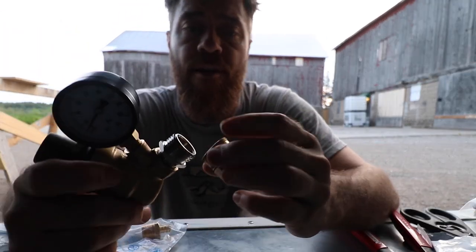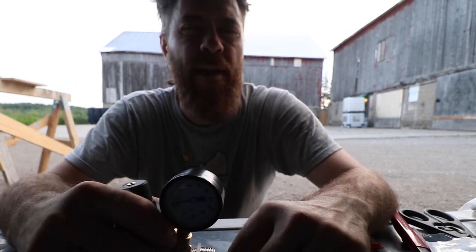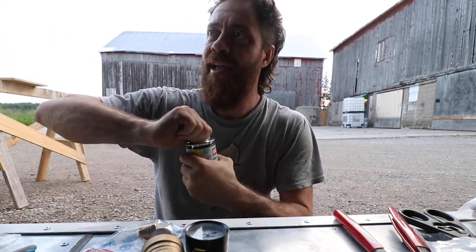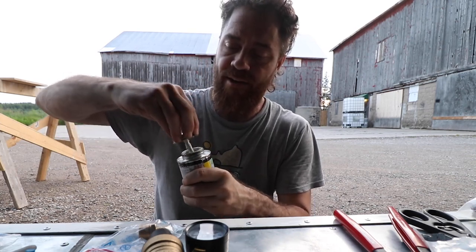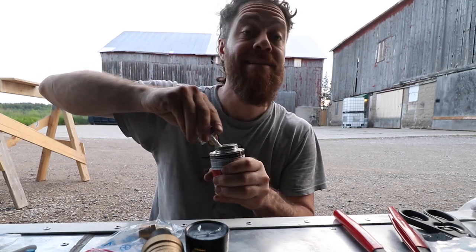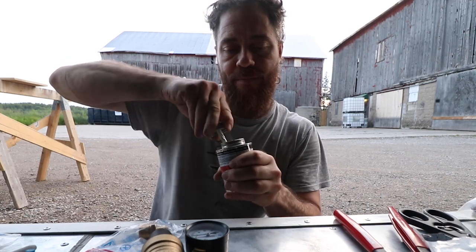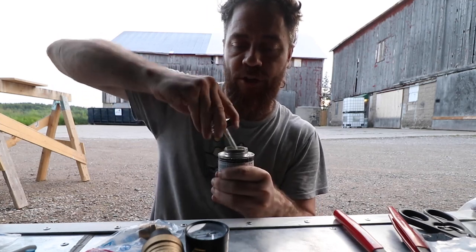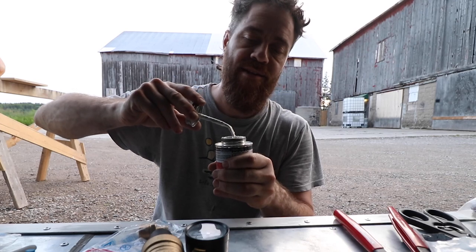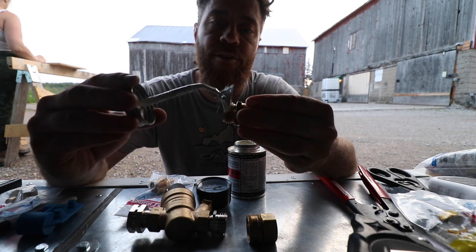What I'm going to do is because garden hoses notoriously leak, I'm going to put a little bit of pipe dope on the threads instead of Teflon tape, just because I've had pretty good success with pipe dope so far, and not so good success with threaded Teflon tape for threads. So we'll give the pipe dope a nice stir because it likes to be stirred, right? Then we'll dope up our threads, get them all dopey with pipe dope, and then we'll tighten these little fittings on. So we're gonna put a nice bead of this on the threads here.